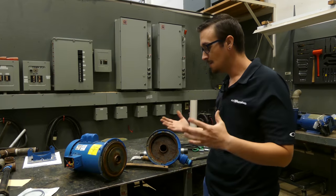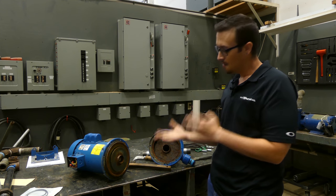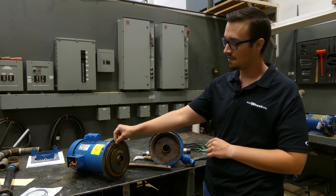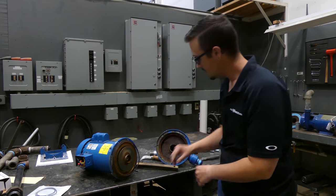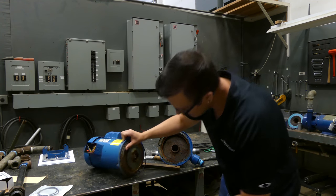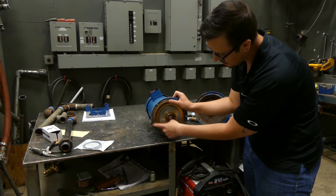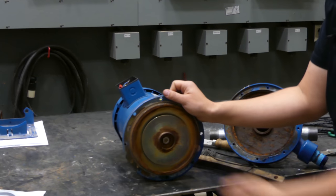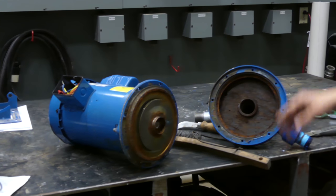So now we're back at it — day two. It was getting late in the evening on day one, so we're back at it this morning. The reason we're making this video is we want to replace this gasket right here. This gasket seals the volute and prevents water from leaking out. We can see down here on this section of the pump there's a lot of discoloration, and that's just because the previous seal was letting water past it.